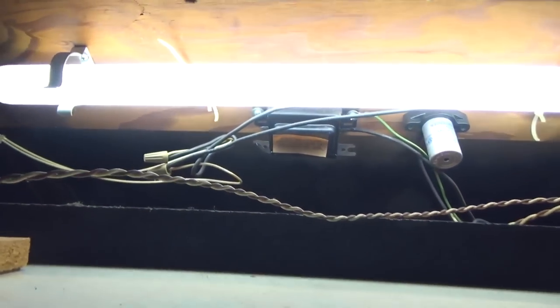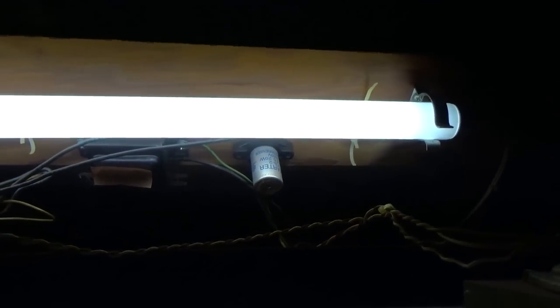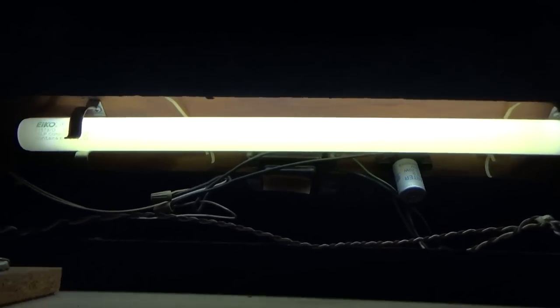All right, I got it all back in there. The monitor's working. It was working before, but we capped it and reflowed it just for preventative maintenance. Also fixed the guy's light bulb, if you ever wanted to know how that worked. It's a light bulb, people. He's got a fluorescent tube. You've got your starter over there and your ballast. And Missile Command actually has the speakers up top behind the marquee.